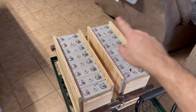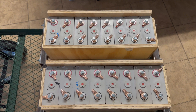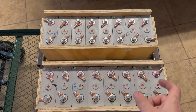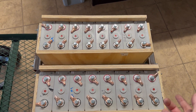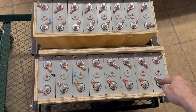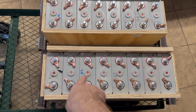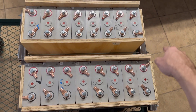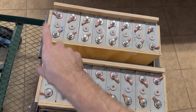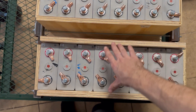I'll probably end up sticking the BMS either in the middle or maybe put a cover over it and put it on top. I'm going to make covers for each of these — I want to use acrylic so you can see through it. I went ahead and put lugs on all the terminals. We're going to be doing flexible wire instead of solid bus bars, only because I don't have any solid bus bars and I have a lot of thick four-gauge wire. So it looks like I have a hundred thousand crimps to do. All the positive poles are on the same side and I'm just going to go across like that. Doing it this way will make it look really clean. On the back, we're going to have the loop connecting the two banks — an 8-cell and 8-cell in series to create a 16-cell — and then our output's going to be there, and then we hook the BMS and put balance wires on the thing.